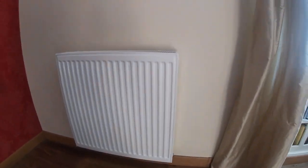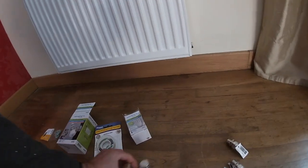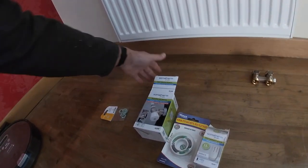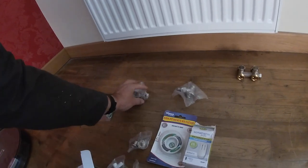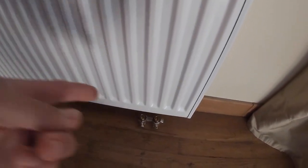There are two types of radiators. One has a bottom entry — two tabs at the bottom for flow and return. The other is the standard type you'd recognise in the UK, with two radiator valves, one on each end. With the bottom-feed type, flow and return both come in at the bottom, and there's an internal pipe inside the radiator that brings the water up and into a T-piece.